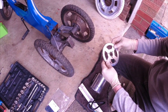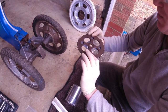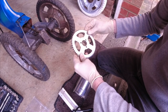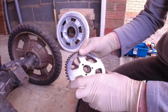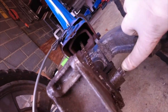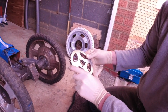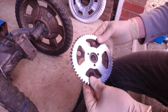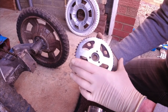While I saw Vinny putting the two sprockets together — they are sprockets, aren't they? I'm getting the terminology right. They're not inside a gearbox. So what are you doing here? I'm just having a look at them — we're going to have to make sure they're centered because we don't want one wobbling around when it's turning. They're going to be tied together. So we've got the original drive that runs off the spline just over here — this is the nice way of doing it rather than completely Heath Robinson-ing it.